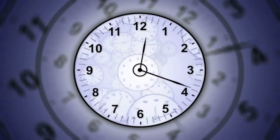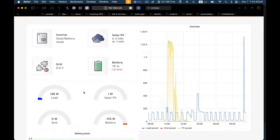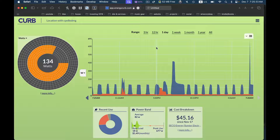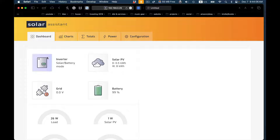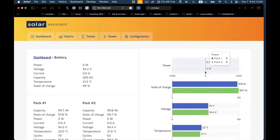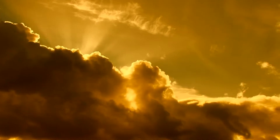We're going to jump to 7 o'clock in the morning the next day. The sun is just starting to come up — we're only getting about one watt of solar power right now — but because we used solar all day yesterday and are running two batteries, we're at 79%. Within the next hour the sun will hit enough to run a couple hundred watts, which will take care of the refrigerator load. Back in the CURB app over 24 hours, you can see all the blue areas where the refrigerator was running. By 9:45 the sun is out full and our batteries are completely recharged — we've started the cycle all over again. Even on a cloudy day, you'll typically be able to draw more power than you need to run a refrigerator and still recharge your batteries.